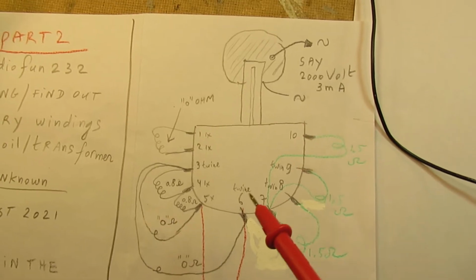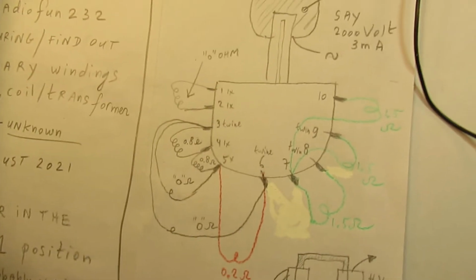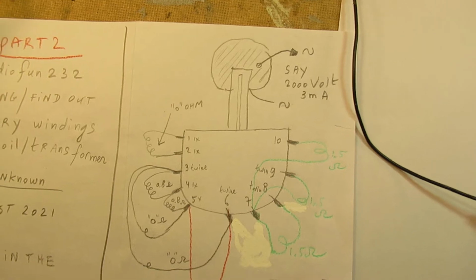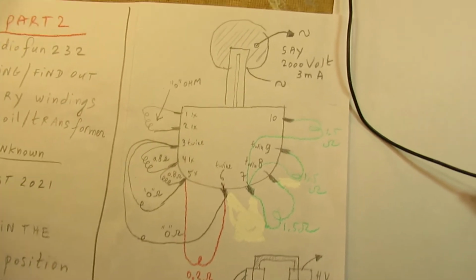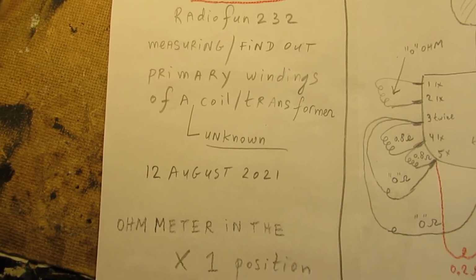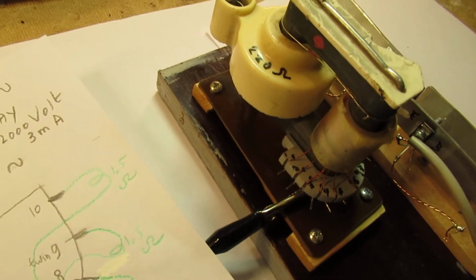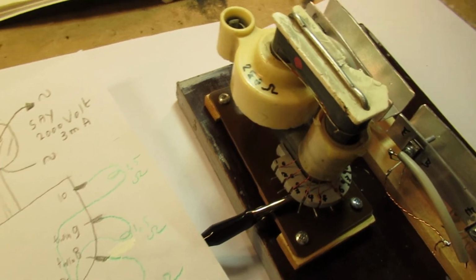because these transformers, high voltage transformers on 16 kilohertz, differ both on their secondary, that's here, and on the primary windings. And when you study old school television sets, you can surely see that these windings are often used in different ways. Anyway, for hobby use and practical use, it's a very good idea to measure it, and you surely can use such an old school television transformer, for the line frequency, as a high voltage generator for all kinds of purposes.